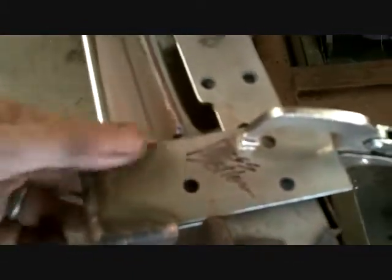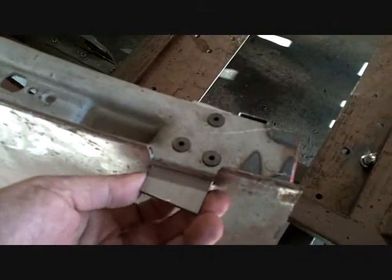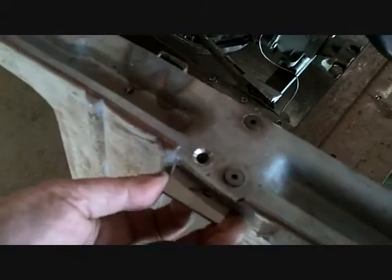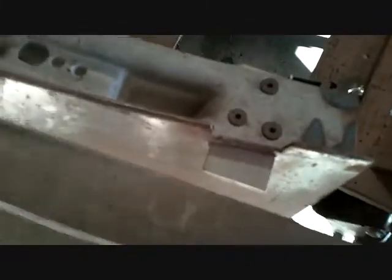It was a great Sunday out with the family. I can't wait to see these things working — I've got so much work into these things. When making the holes, when I copied the old hinges, I made them to .3 so they have a little play up and down — a little wiggle on both of them. If you take a square and put them up against them, look at that — beautiful. It's hard to hold one-handed but it puts right up against it, no problem. I just got to trim off — I think it was .316.